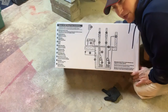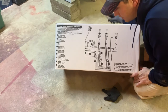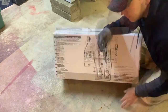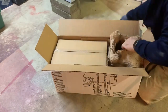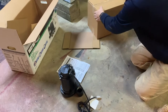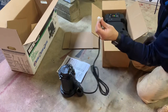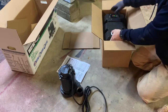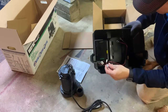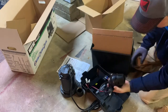So this serves two purposes. One, if our power goes out it's usually when it's raining — usually when you need your sump pump — so this will back that up. And also if this pump just fails and stops working, this one will kick in because it has a separate float switch. Here's what's in the box: a sump pump — pretty standard — and a battery box housing. This is a different kind of sump pump — it runs on DC power from the battery. These wires probably go to your float switch, and this charges the battery.